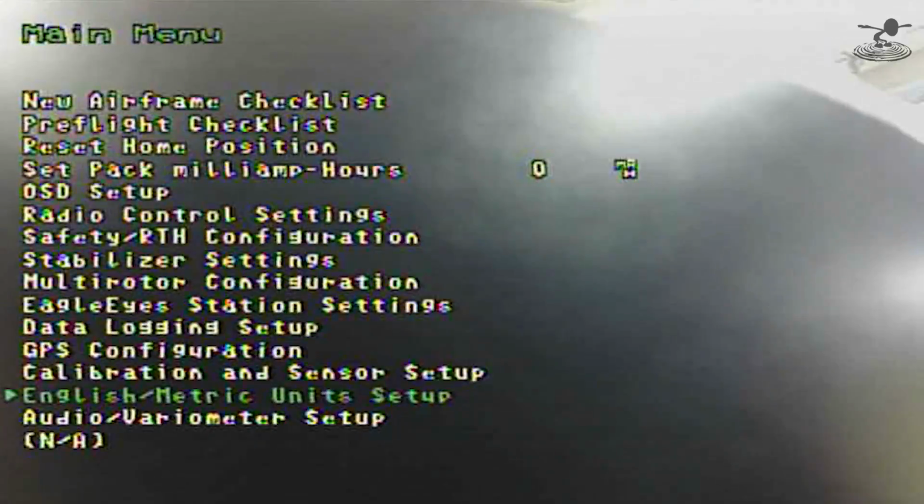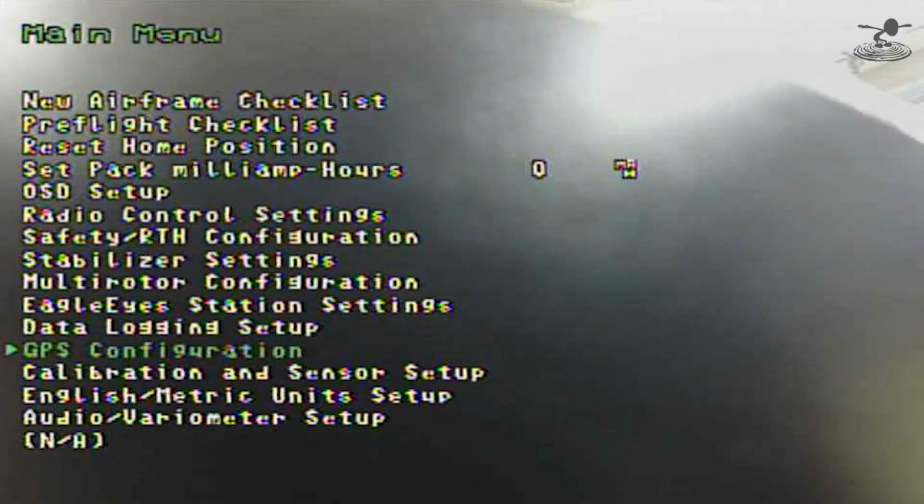Very good. So basically, once you boot this thing up, you're still going to want to toggle through the menus and look at all your settings because there's a lot in here you don't want to miss. You could probably fly around with it, but it's still safe to reset your gyros, center your compass, and do all that stuff. It's the difference between a flying machine and a well-tuned flying machine. Oftentimes these features are neglected, and they're often brought by firmware updates. All the reason they're putting that on there is to give you a better flight experience. So don't neglect going through the menu, and if you need to, go through the manual again.